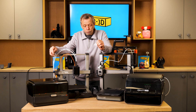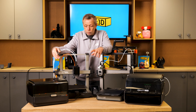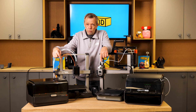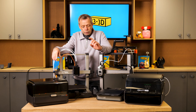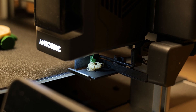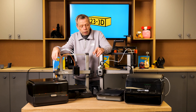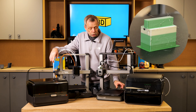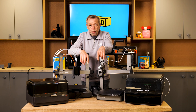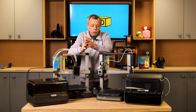I should mention print times and waste, because that's a big one for a lot of users. Filament costs money — the less waste, the better. Both of these machines produce as much waste as any other printer using multi-color printing, apart from those that use multiple tool heads. The extruder needs to purge the previous filament from the nozzle to get the new color through cleanly. It does this in two ways: purging through the nozzle producing waste blobs, and printing a purge tower on the build plate. Both machines do that and produce the same amount of waste.